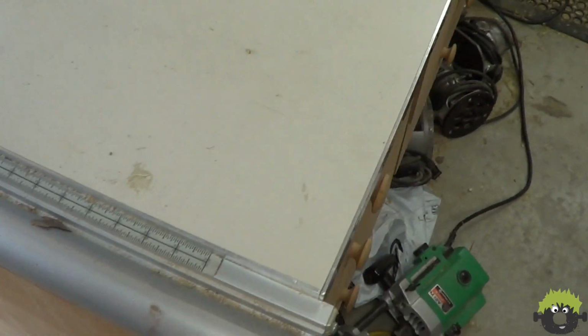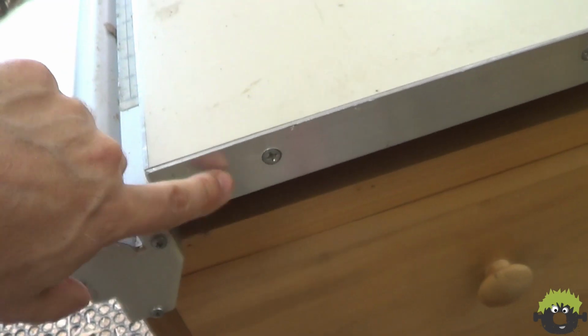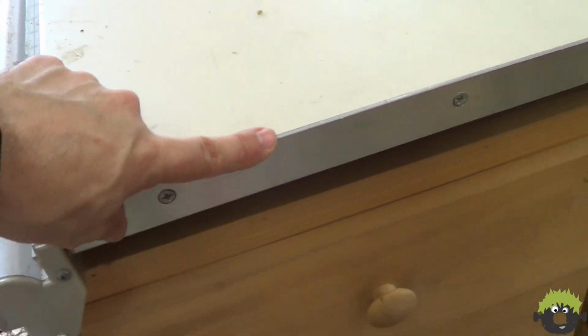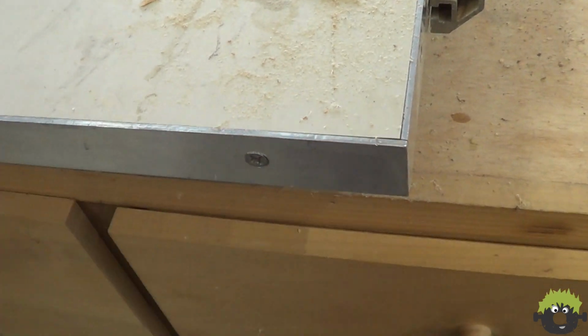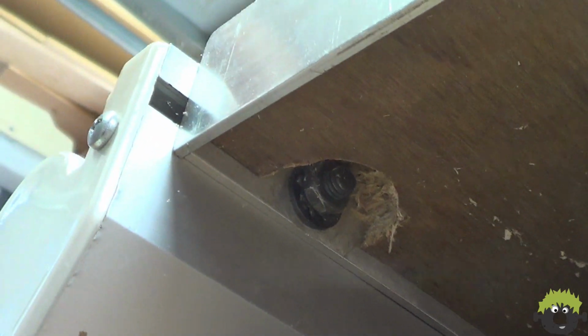I had replaced the two cast iron wings that came with my saw with some laminated office desk cutoffs. They're about 1.25 inches thick, and I banded these with aluminum strips to provide a way to bolt up to the fence and reduce edge chipping of the laminate when I slide material around. This also had the bonus benefit of preventing sawdust from falling through the openings in the old wings and piling up on top of each drawer unit.